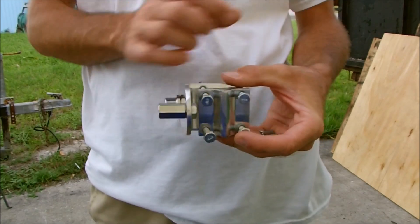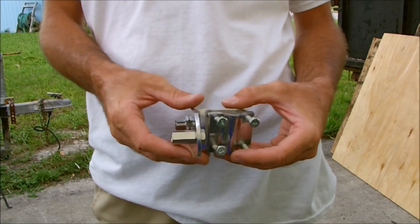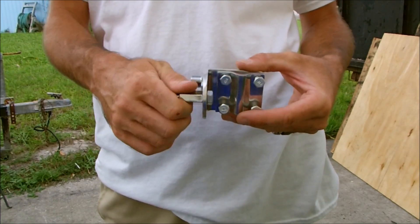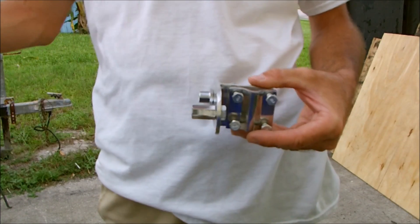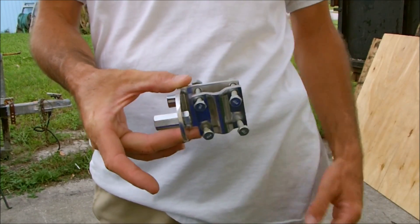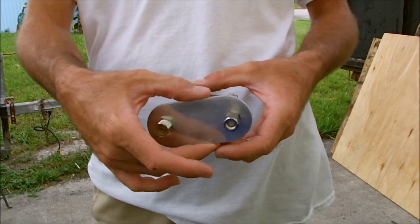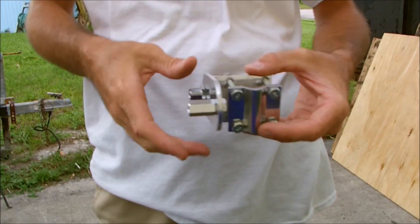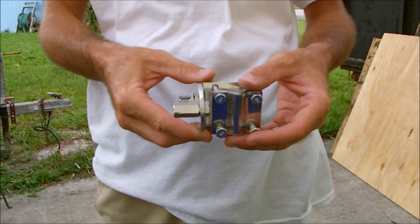You can make a horizontal dipole using two hamsticks or a vertical dipole using two hamsticks. I tried this out at field day. I could put a 20-meter hamstick on each side and have a half-wave dipole that I can rotate manually or automatically with a rotator and tripod — easy to set up in the field.